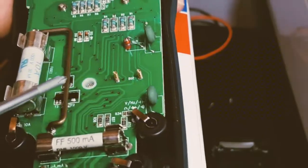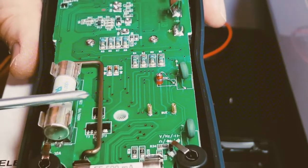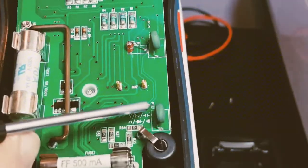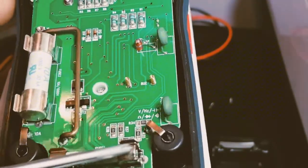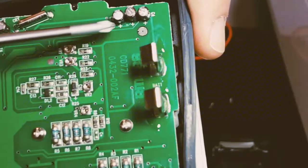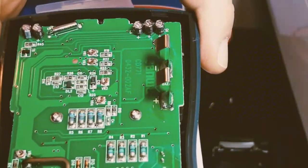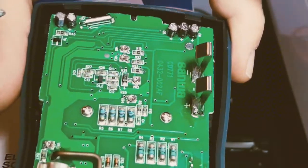The rest of the PCB looks fairly decent. This is the connectors for the piezo, the little springs here. We got 2 PTCs, which is always nice to see. And we have a little GAP device right here. You don't see that all the time. Going down the board, a lot of resistors, more caps, some trim pots over here, some surface mount caps on top, crystal oscillator here, some more surface mount caps. And we've got the leads for the battery soldered directly into the main board.